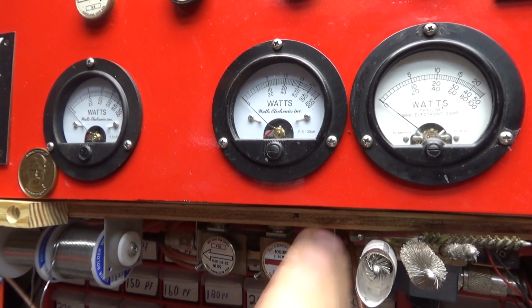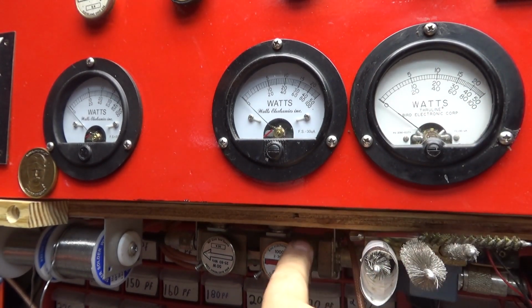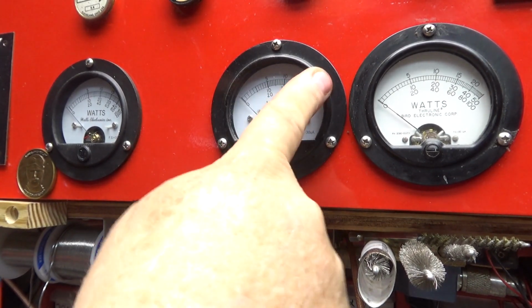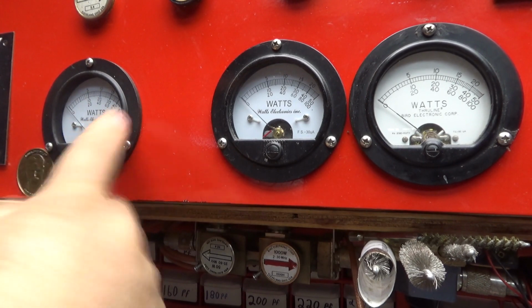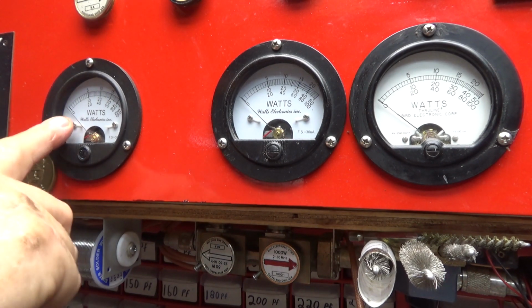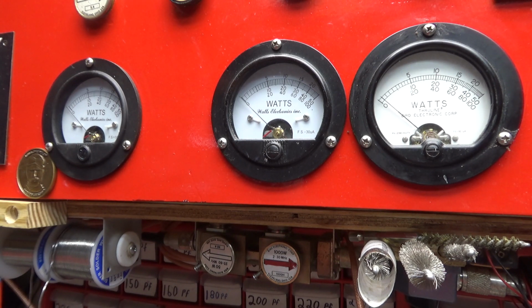Then peak right here, 1000 watt slug. His reference right there, 1000 watt slug. 50 watt slug for the antenna, and 5 watt slug in reverse going back towards the radio. Alright, she's turned on. Well, let me turn it off. Talk through, you need to look through here. Audio. I got the talk through looking perfect. It did have the connector that was kind of loose and kind of dirty. I cleaned it up and moved things around a little so it would make connection.